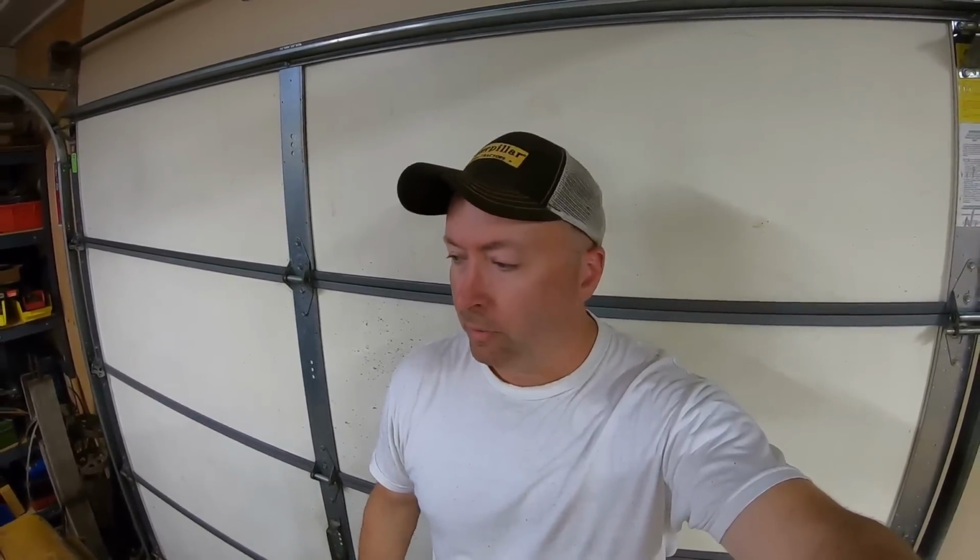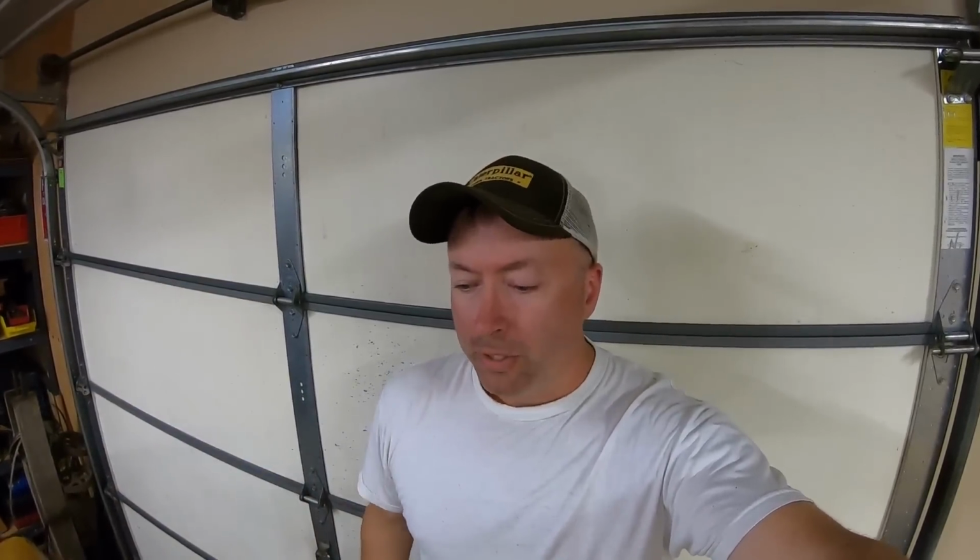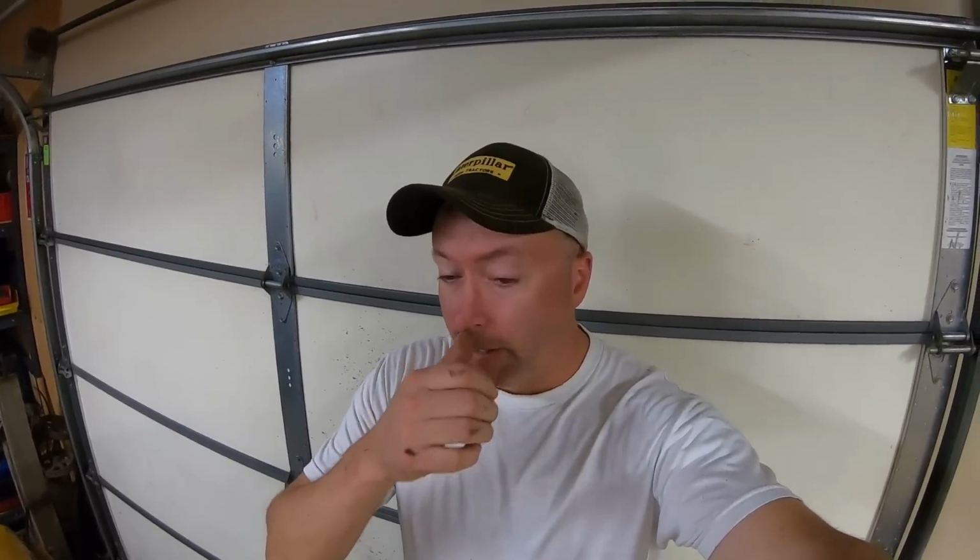Now for that intermittent pop noise. I did a comprehensive fuel bleed on this off camera before I even started it up, and I really didn't see any air come out anywhere, but I hit every bleeder in sequence, both on the tower, all 4 on the individual pumps, even cracked lines again. Never got any air out of it that I could see, and the intermittent pop accompanied by a white puff is still there.